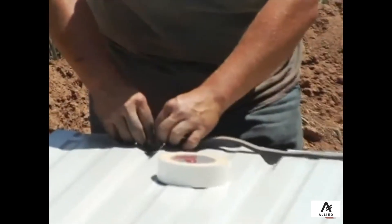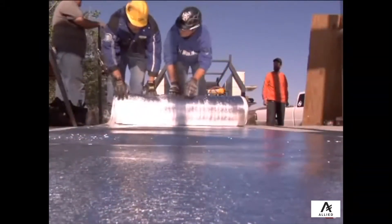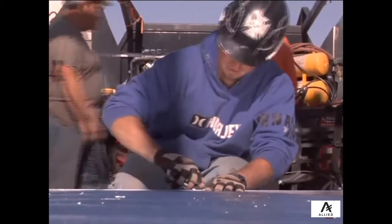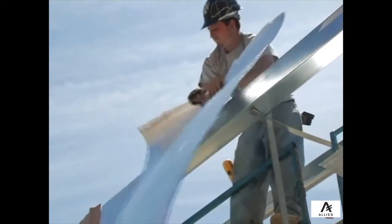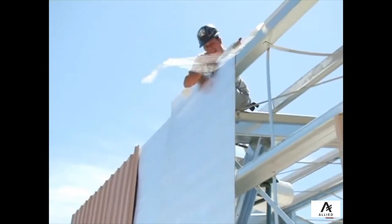Once wall sheets are fully prepared, you may need to install insulation. If so, this will need to be installed before the sheeting, as the sheeting will lie on top of the insulation. First, cut the insulation to the proper length, which you will need to measure beforehand, and then after pulling the insulation tight, secure it to the frame using double-sided tape and make sure to cut off any excess.